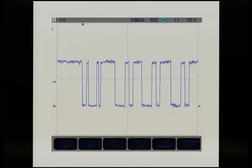You can sometimes differentiate a digital output and a digital input by the voltage. A digital output will be driven by FETs, say it's pulled up in this case, and it will be very close to your 3.3 rail, so 3.29 volts. Your input will be quite weakly pulled up, and sometimes you can actually detect that. You can guess that it's an input because it might be 3.27 volts. It might be a few millivolts less. And sometimes you can test this.